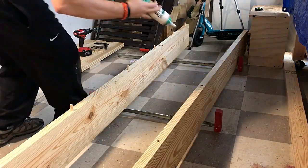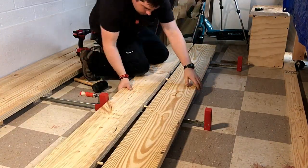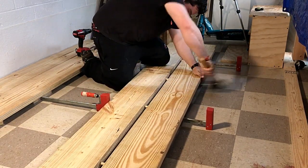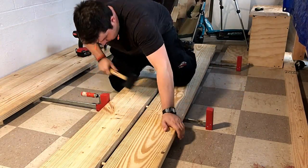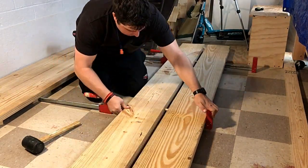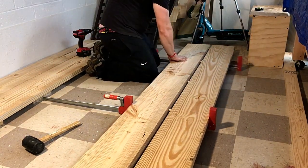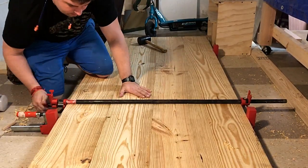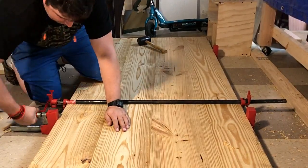Because they are so long, I used a bunch of dowels to keep it flat and add strength. I had four pieces down to 10 inches each in width — they were initially 2x12s — and I put them all together, first in two sections and then joined those sections together.